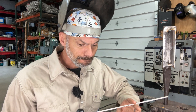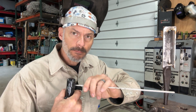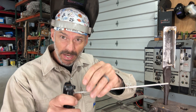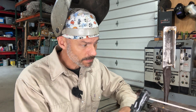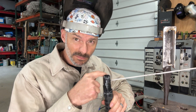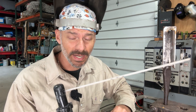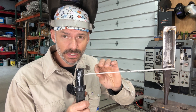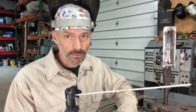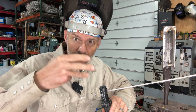I've seen guys take these rods and bend them a couple times, wrap them around their stinger, and then take it out and clamp it to make them shorter. That goes back to the shorter welding rod. I don't recommend that though, because a lot of times that thing sticking out will arc off on something else. Also make sure your stinger is holding the rod tight. If you've got slop in your stinger, even just a little bit, it is going to be awful. When you do strike off, it'll click to the next — those Tweco jaws have different levels. I've had that happen — it clicked in one and stuck in the side of the pipe and almost blew a hole in it.